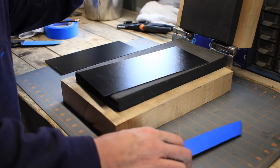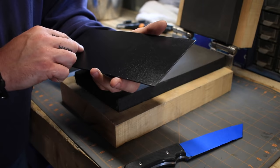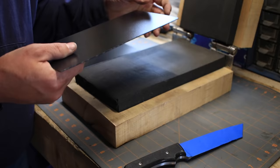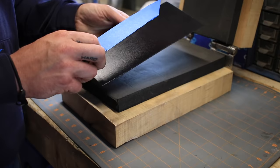And you wanna make sure you get any little tiny specks of dirt or dust. Being in a one room knife shop, sometimes it's hard to contain my messes. So I keep my Kydex wrapped up, but at the same time, I just wanna check for any grindies or chunks of metal. You'd hate to press that against your blade and go test fit it a few times and put nasty scratches in your blade, so always a good idea.